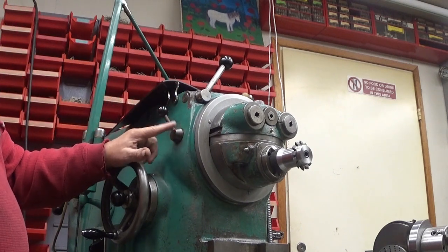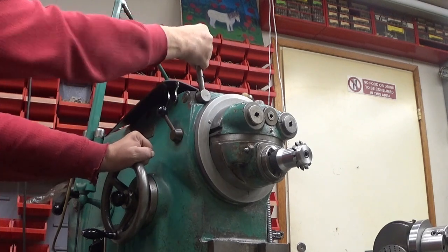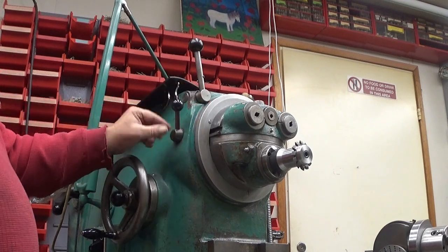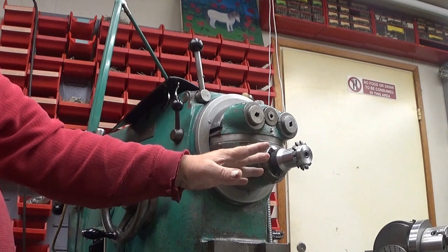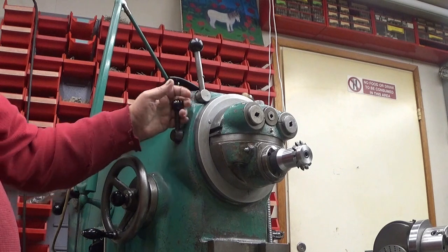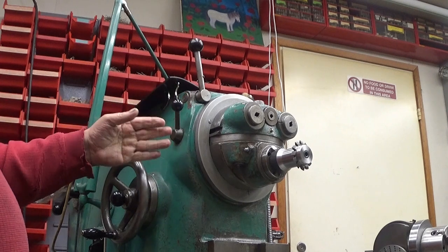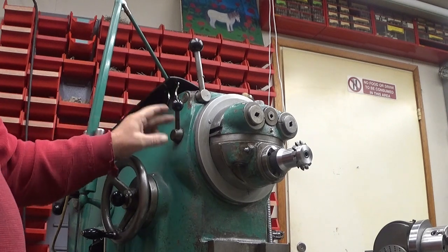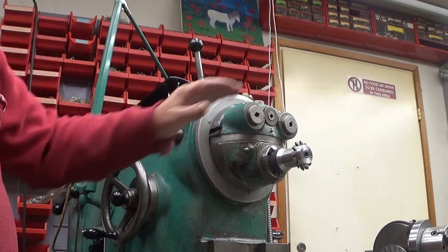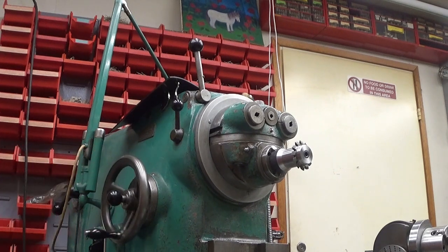You never leave this actually locked. Then you engage the brake. And disengage the indexing system. This is such a thing that if something bad happens here, it will. That's the weak point of this machine, this indexing. And if that breaks, you are in for taking apart your machine and setting things up there. So now it's locked in place. I can put this on free gear.